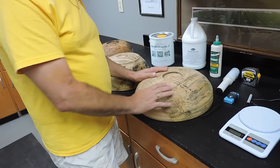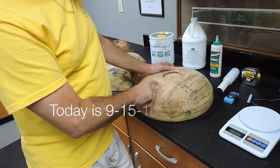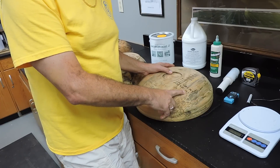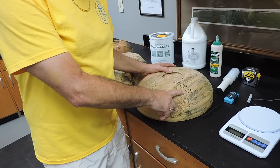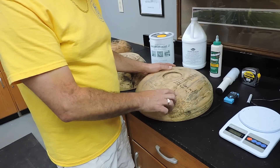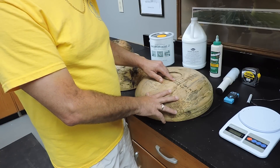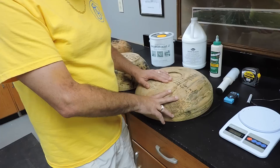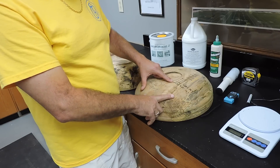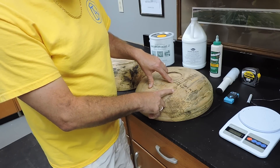This particular bowl started out at 4914 grams; today we're at 3490. We started out at 34% humidity and now we're at 14%. Now 14% here — where I live in South Alabama, where our humidity is around 100% most of the summer — that's about as low as I'm going to get. I'd have to put it somewhere to really dry it further. But I do keep weighing it and it's still going down, so it still has some moisture in it. I go more by the weight than the meter — when it quits losing weight, there's nothing else to remove. Last month it was 3542; this month it's 3490, so it's still losing weight.